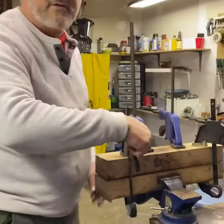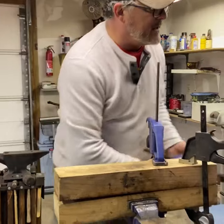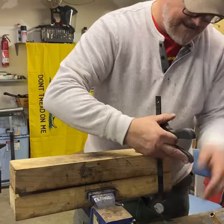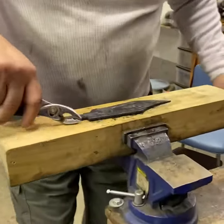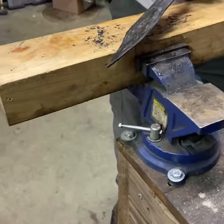It's been in the straightening jig for about five minutes now. We're going to take it out and go straight into the temper cycle. I'm using the kitchen oven set at 400 degrees — we're going to do that twice for two hours each time. It's still warm, but it's straight, and it's a hard blade. On to the temper cycle.